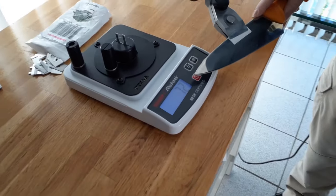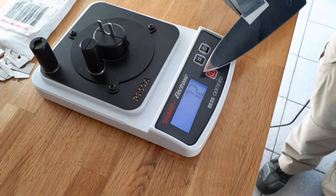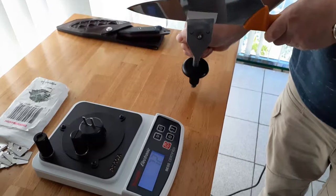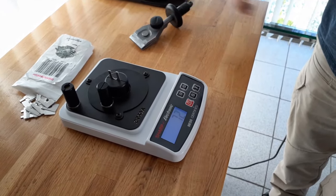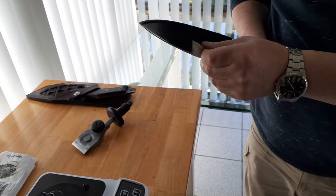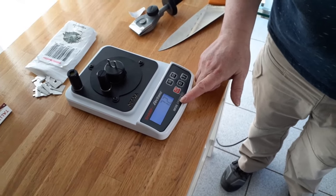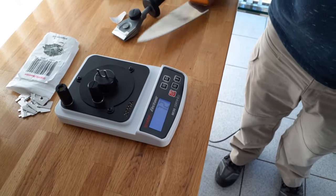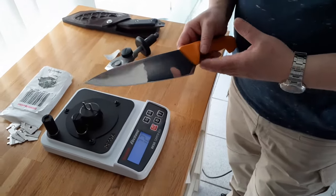Note the sharpness reading. This sharpness is similar to the sharpness we get by honing with the Tormek honing compound after a fine grinding wheel. Lest we forget that we set the edge on the coarse grinding wheel. The sharpness score of 72 tells us that there is no residual left on the edge, and the apex is clean. Actually, it is near razor sharp.